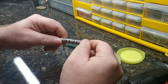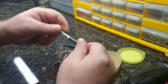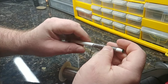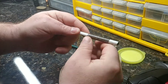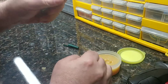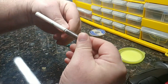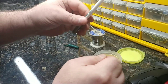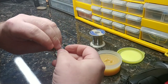Anyway, you roll the solder on there and keep squinching it up so you can get quite a bit on. Just keep rolling, and make sure you don't overlap. You hold quite a bit of solder this way, so now you've got this as your portable solder supply to go ahead and do your work.